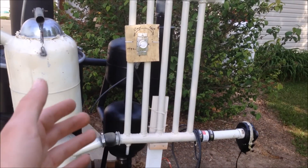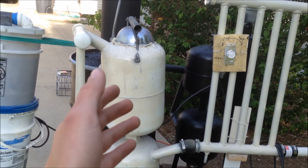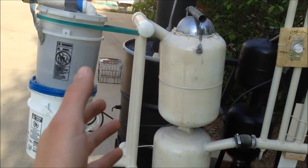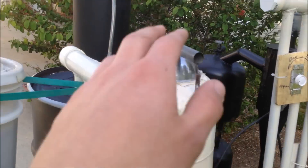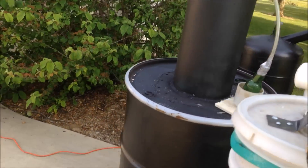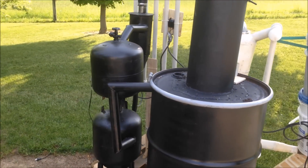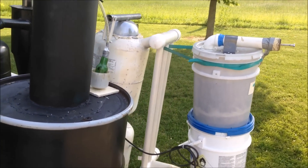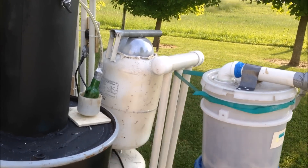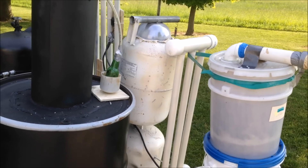Additionally, I've painted my radiators, my second cyclone, and first filter. I painted this whole part white. I painted my first two cyclones and my main unit and hopper black. I painted those black because the paint will burn off anyway with the heat. I painted the radiators and my third cyclone and first filter white because they need to be reflecting the sun's heat to stay cool.